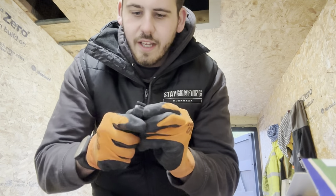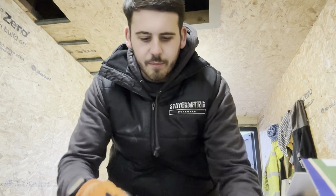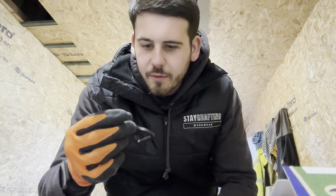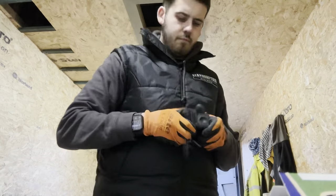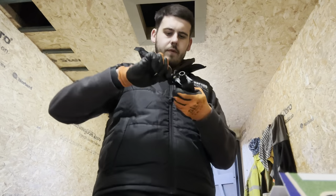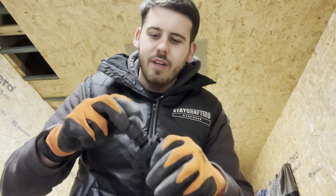It's the official tool for the stuffing glands — it's the exact same size as the stuffing gland, so you don't get any grip marks. When you usually use regular grips, they can score the gland and leave horrible marks on it. This just fits nice and snug and then you can do up your stuffing glands. The box also comes with this little tool — one side is like a bottle opener, and the other side you can put a flathead bit into it which does the lids of the Wiska box — it fits perfectly into the lids.